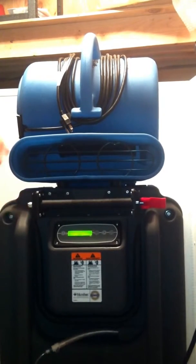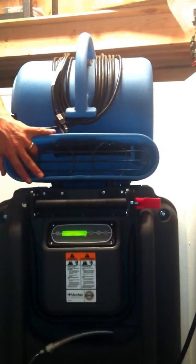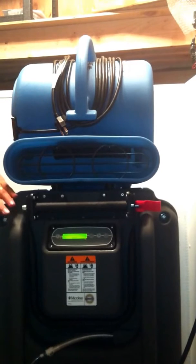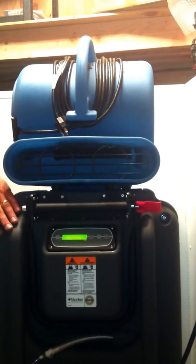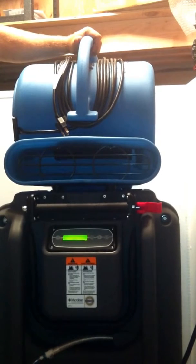So if you have a leak, or water on your carpet or wall, you want to make sure that you have a maximum amount of airflow going by, so that the moisture is pulled out of the substance and into the air, and then you want this dehumidifier working simultaneously. We rent this particular machine with two fans as a package deal.